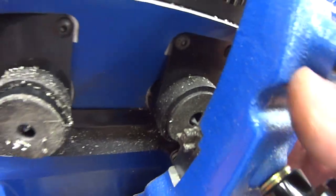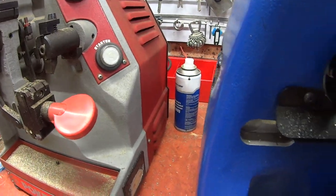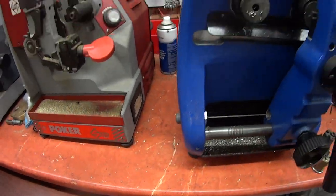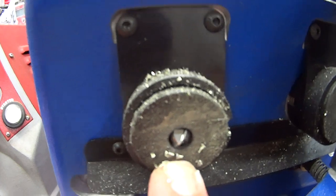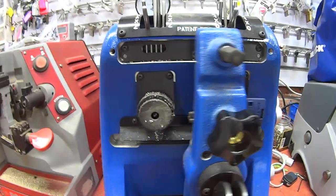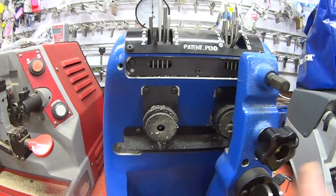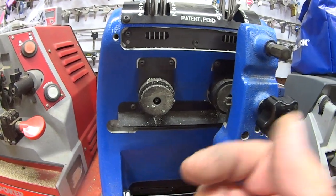If you don't get a good clamp or your spacing is wrong, you can cut into that floating element — and it's different in different countries. You can see that round section on the key; if you cut into that you're going to wreck your cutters. You have the cutter on the outer and the cutter on the inner side. If you do wreck them, you simply slide them out, slide the new one in, push it all the way back, and tighten it up.